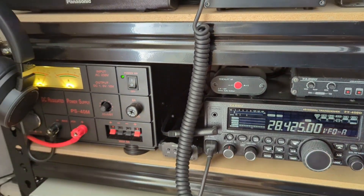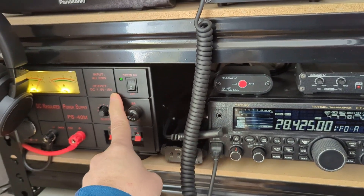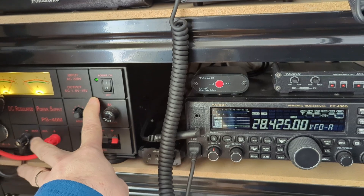So that's a brief rundown on how I reduced the noise floor in the house — it went from about S9 down to about S3. You can get it lower simply by using an attenuator or switching off any preamp on the HF rig, which Yaesu call IPO. There are all sorts of things you can do to improve the signal-to-noise ratio on the bands. One last thing: I switched a switched mode power supply for a linear power supply and it made very little difference, because the switched mode supply I had only had a few birdies on 80 and 40 meters with a detuning control available. So that may not be your answer.